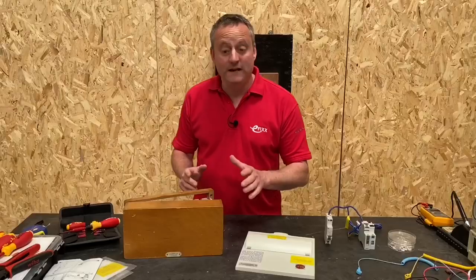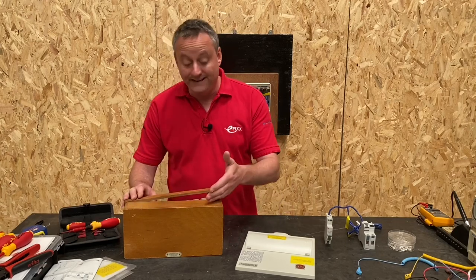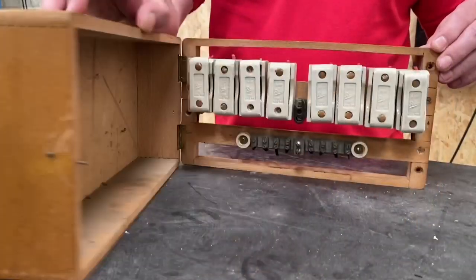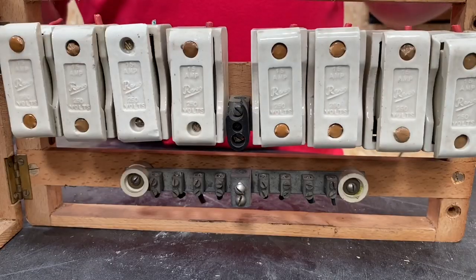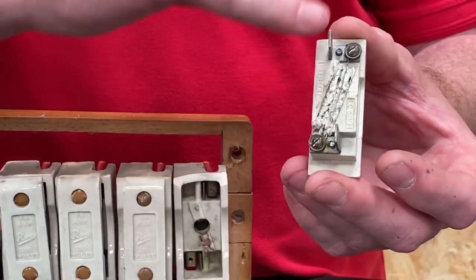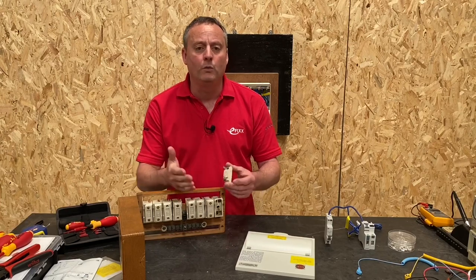Let's first consider where we've come from and where we're going to. This consumer unit here is made of wood, a combustible material. It's also probably coated in a lacquer that is even more combustible than the consumer unit itself. It has no tool or key in order to enter it, and when I open up the enclosure we have no protective bar, no CPC bar, and no means of isolation built within the consumer unit. As I pull out an overcurrent protection device it has an asbestos pad and a piece of copper wire which is smaller than the conductor in circuit, and when there's a fault we hope this wire melts before the one in circuit.